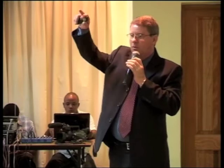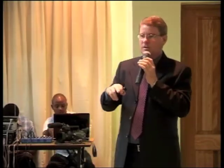If there is a road with an underground cable, and when we reach some portion it's necessary to put an aerial cable, it's consensus that we can use the underground cable in this aerial portion, because the underground cable generally is more protected than the aerial cable. It's possible to have most of the installation as underground cable, and in some part, a crossing or some place where it was not possible to put ducts, the same cable goes in aerial installation.